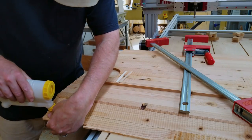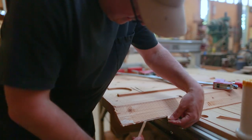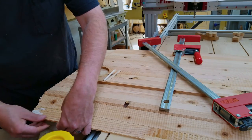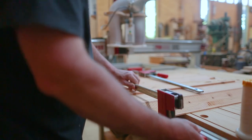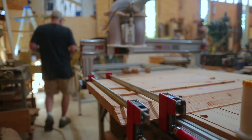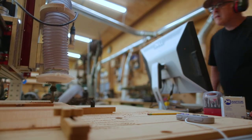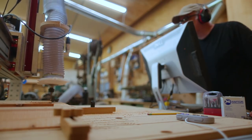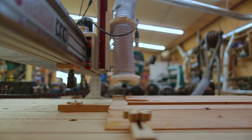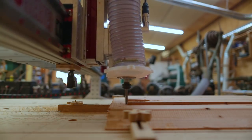On the first table I cut all the way through, which was fine except a corner of the front edge came apart — the wood gets really thin there and it splintered. I was able to glue that section back together. I also found my measurements were slightly off; the tables were ever so slightly too big, so I manually cut off just a little bit of the width and then it fit just fine.